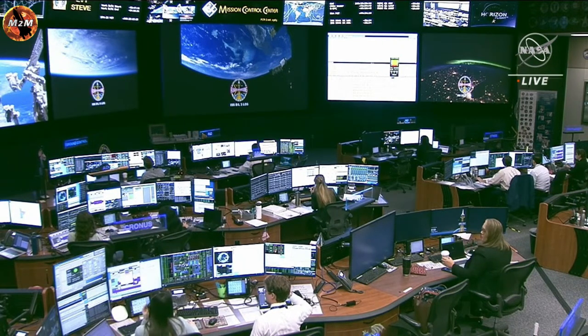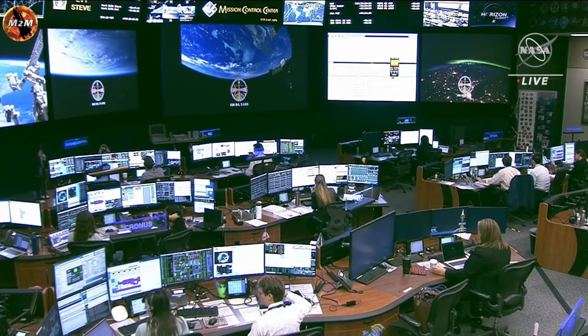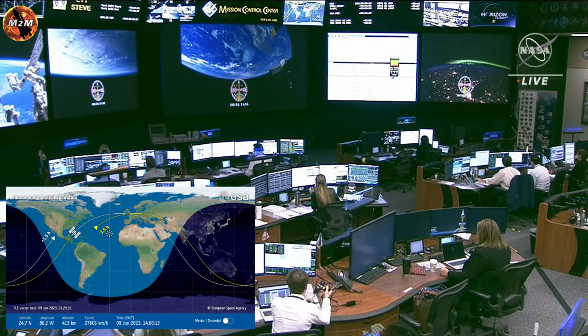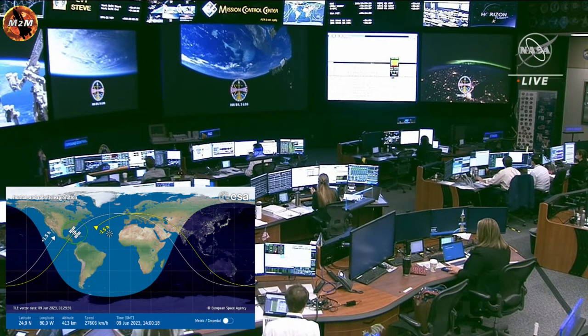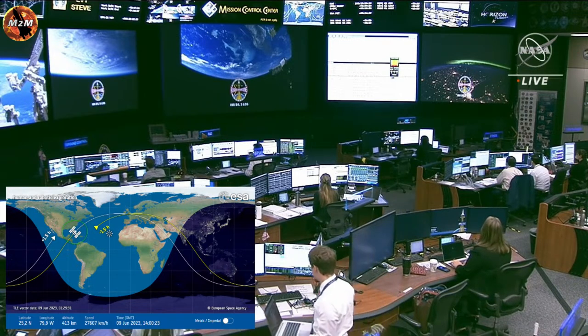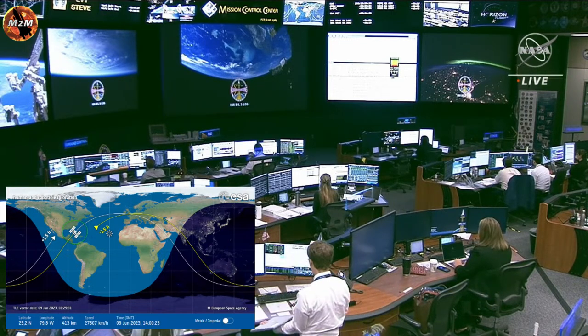All right, that bolt is released. I got 27 turns. I let it do a couple of bumps so that it would verify that it was clear. Copy, 27 turns and the bolt is fully released. Can you see a white line indicator? And there's a white line indicator. Copy. You can stow your PTT.